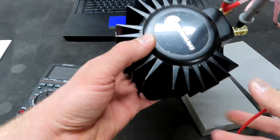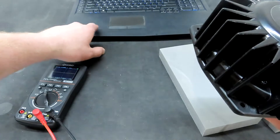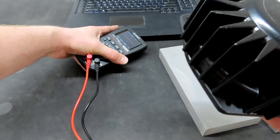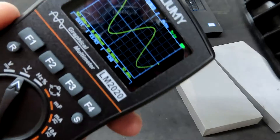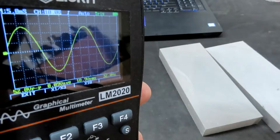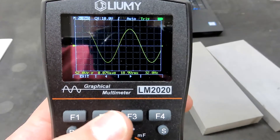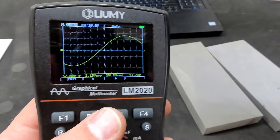We're going to play a frequency on this bass transducer here. We have 32 Hz set up on the laptop — we'll play that. Watch the screen. Right now zero, then 32 Hz. Wow, that is a really good sine wave. You can change the time scale right here — it gives you a little left and right, so you can zoom in on that waveform nice and clean.